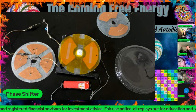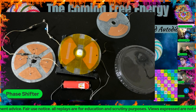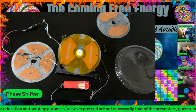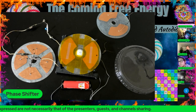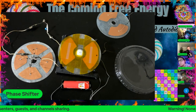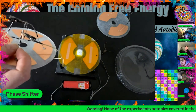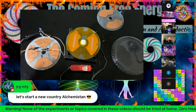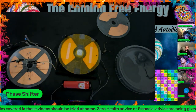I've looked at just every electrostatic influence machine throughout history that I could find a picture of or a diagram of or drawing or anything. And I've not seen a pure induction machine with absolutely no brushes anywhere in the circuit. But the reason for that, I think, is actually really simple. You see, only 20 years ago, these diodes didn't exist. They're a fairly new thing, and the fact that I can use them on both moving discs and stationary discs is a brand new idea that hasn't been tried so far as I've been able to find.